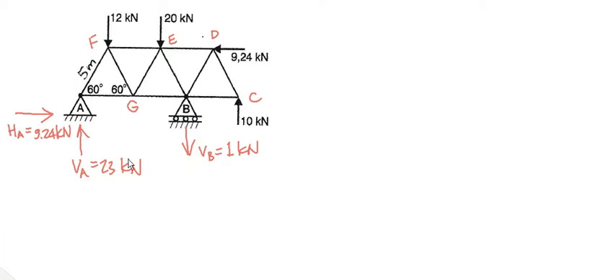So, whenever we solve a frame, the first thing we need to do is find the reactions. Just a bit of revision again — we took moments about the pin joint first. We took moments about A to find the reaction at B. Then we took moments at B to find the reactions at A. You can't take moments about a point and find the forces at that point, because if you take moments about that point, VA and HA are acting through A, so their lever arms will be zero. So: take moments about A to find VB, take moments about B to find VA, and then sum the horizontal forces to determine HA.